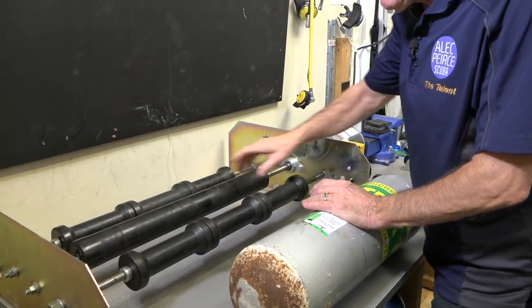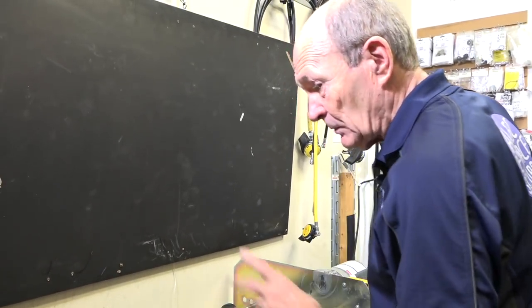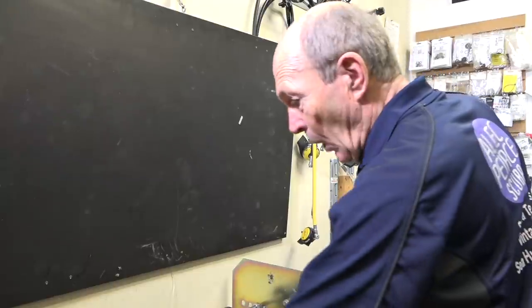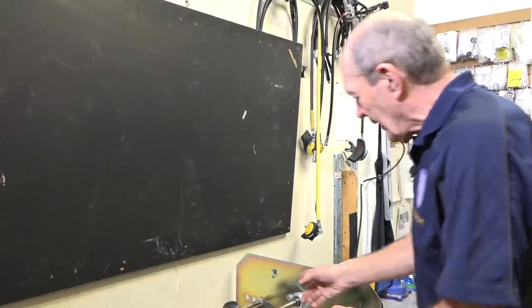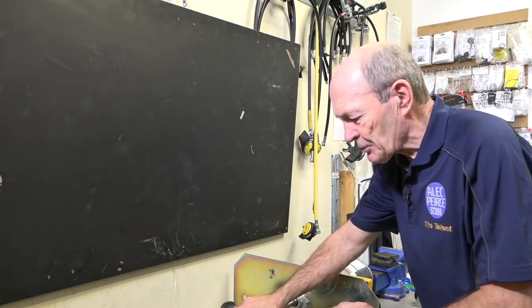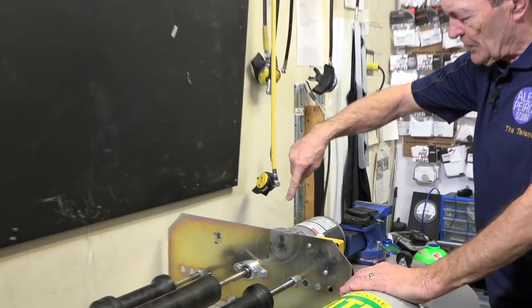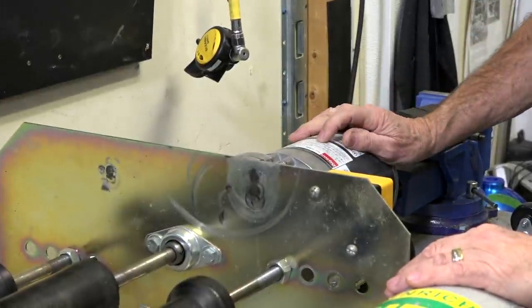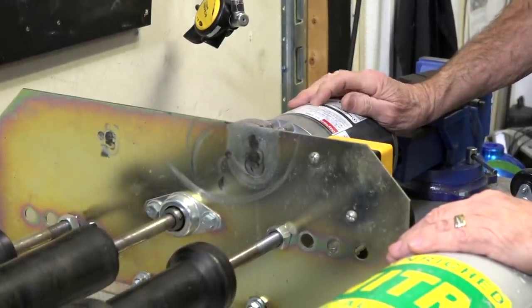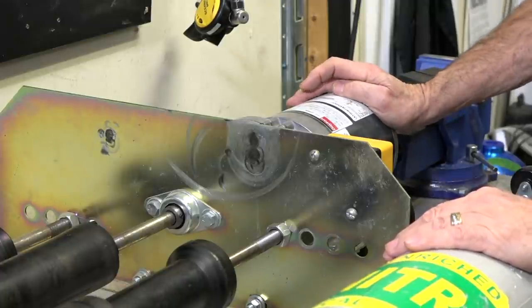So you have one of these rods between your two plates that is free spinning, and the other rod is driven. What I mean by driven is you should really mount this steel rod in a bushing if possible - not actually necessary. A nice ball bearing is the best, but just a plain bronze bushing would be good at one end and another bushing at the other. So this thing is driven, and that rod goes right through and connects to a motor.